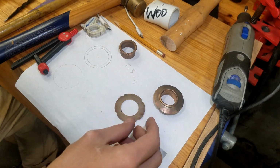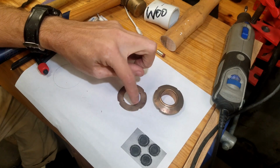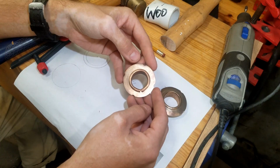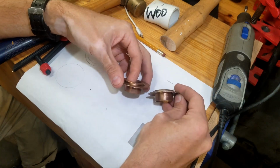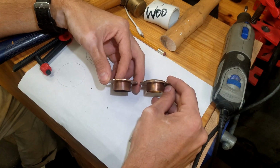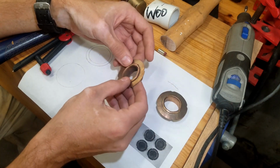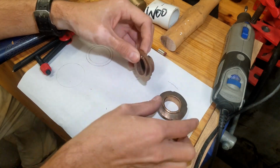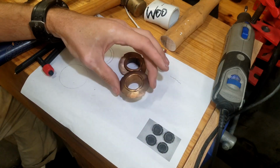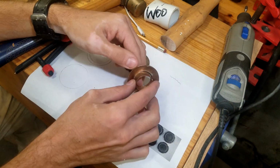For these pieces, I use the same hole saw that I use for the cabinets to cut out the central piece so that this will drop in, lay down there. All of them are going to have a bit of convexity given to them, just using the pritchel hole on the anvil. The ones that I'm going to inlay on the cabinets, I'm going to keep flat so I don't have to inlay as deep. The curved ones, all the other ones on the outside of the cabinet and drawers and everything, will have this raised rim to it.